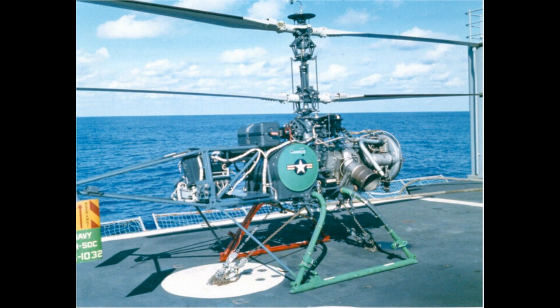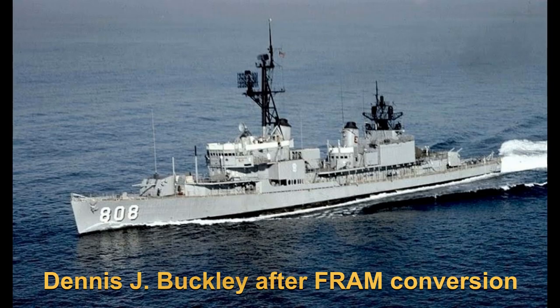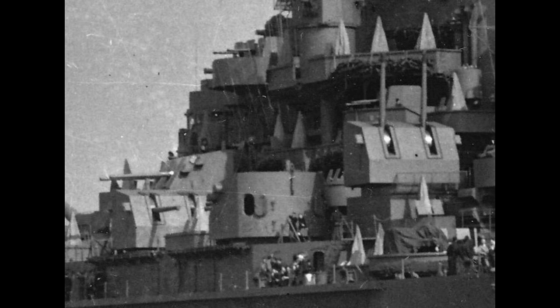At the end of World War II, there were a bunch of brand new destroyers that had been built and were now surplus. In the 1950s, the Fleet Rehabilitation and Modernization Program, also known as FRAM, came around. The idea was to convert them from surface combatants to modern sub-hunters. They removed some of the 5-inch .38 cal mounts — the .38 caliber meaning the barrels were 38 times 5 inches long. These were one of the most successful weapons developed during World War II.